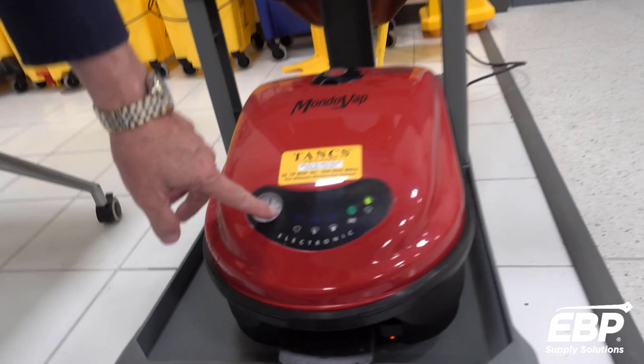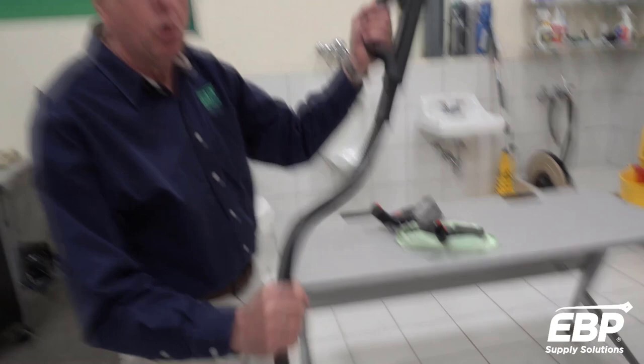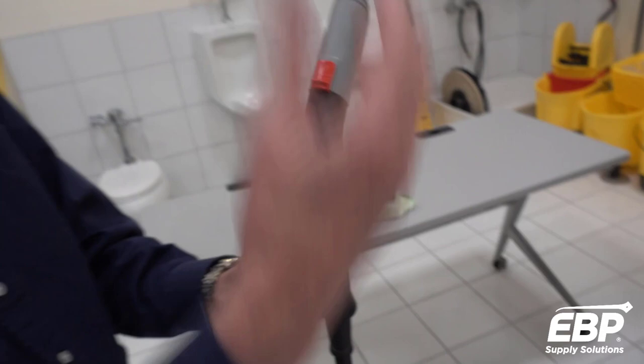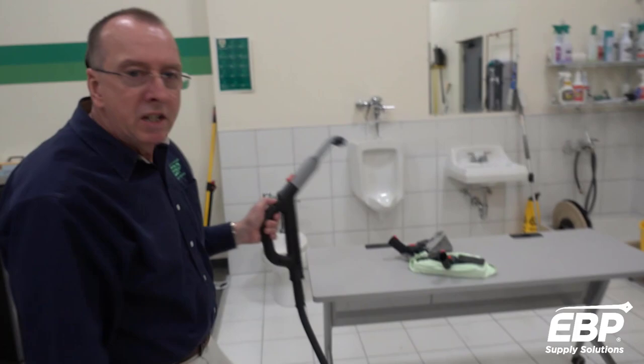If you come and look at the machine, it took about seven minutes for the steam to come all the way up to temperature, and we got a green light on the machine so you're ready to go. The first thing we need to do is purge the hose because the hose is cold and the tool is cold. I have the option for switch one which is low, two is medium, and both switches gives me high power. I'm going to put both switches on and blow some water through this for about 30 seconds.